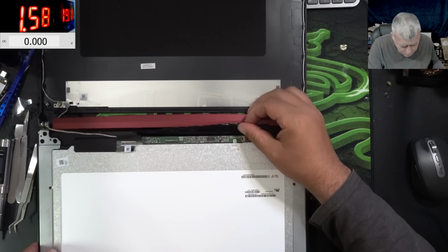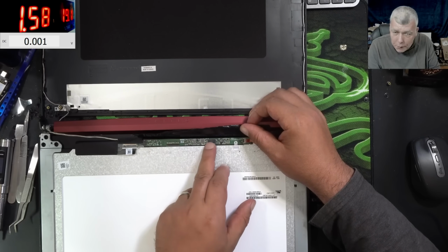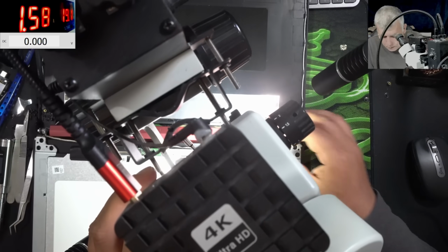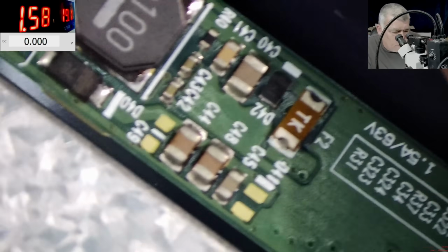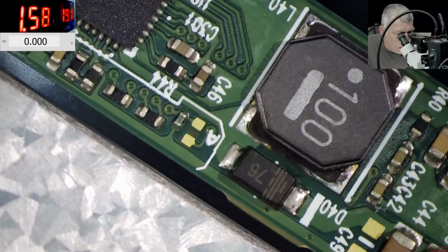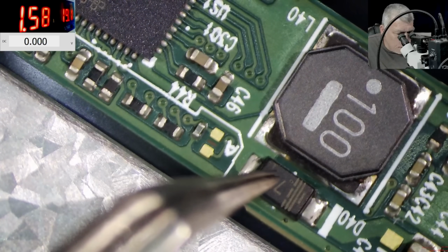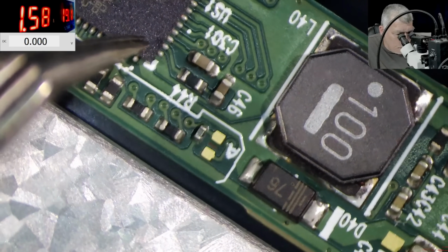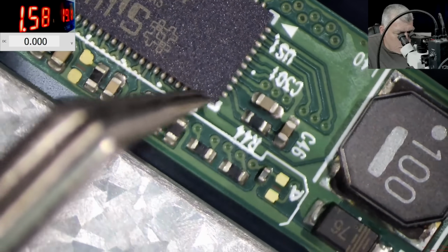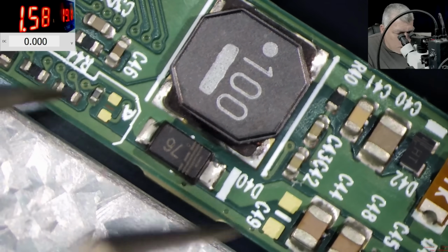You know, I have a bad feeling about this job. I mean, this is a big chip, right? Which probably has something to do with the picture. Who is switching that coil? Oh, okay. I got it. Probably this is a high frame rate screen, so the coil is switched by the chip, by this one. Probably the chip is not dead. Probably the signals from the EC chip are missing.